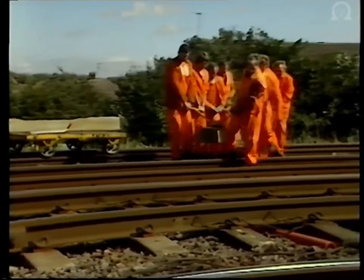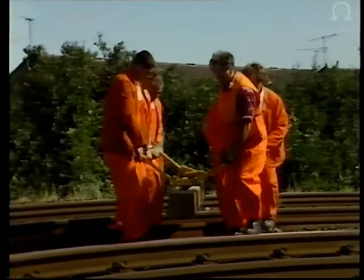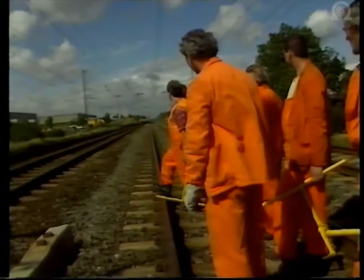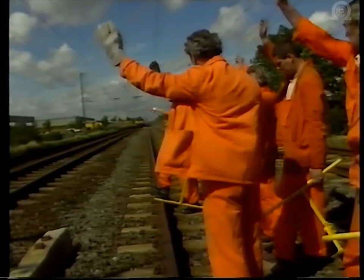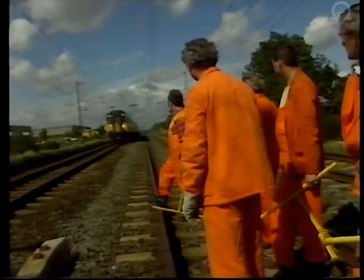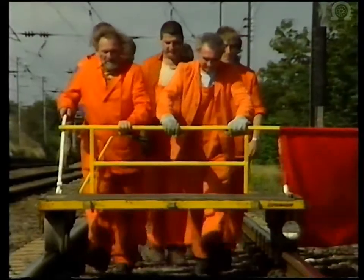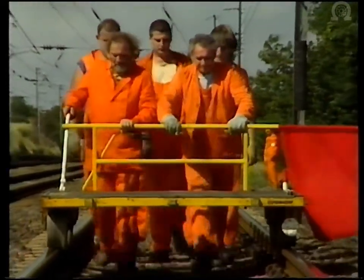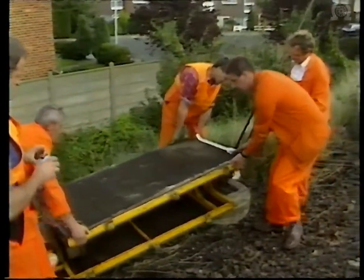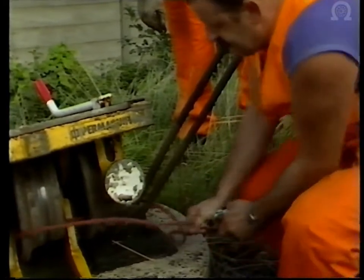At the site where maintenance is to be carried out, the new sleepers should be unloaded as quickly as possible to make the line available for traffic. The sleepers must be put down safely between tracks, and the gang must respond promptly to lookout warnings. Once the trolley has been cleared, it should be moved in the direction of traffic to the nearest forward access point, lifted from the track and padlocked at the line side for security. Line possession can now be handed back to the signalman.